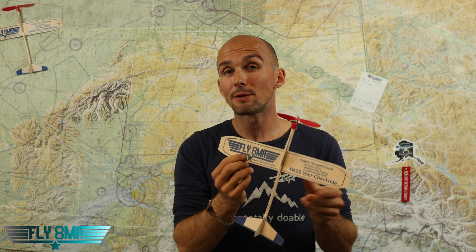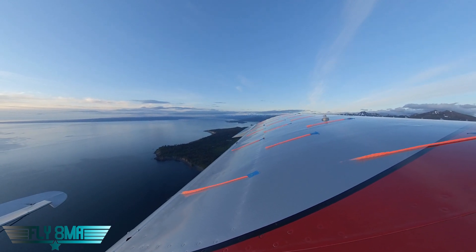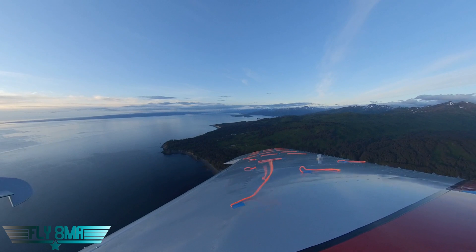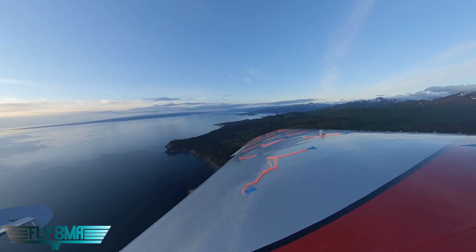It's already a good design, but it was definitely improved, and I think there are things you can do with VGs besides just performance. You can make your airplane a little bit safer — when you're sticking them on there at 7, 8, or 9% of chord on the inboard side and putting them further forward on the tips, you're going to have better control authority throughout that stall for your ailerons.